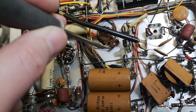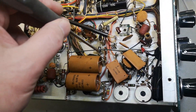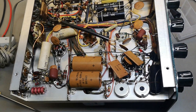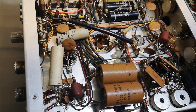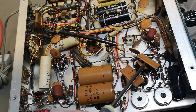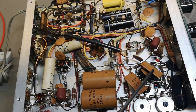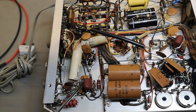The two primary windings are in series correctly, so I can plug this into local mains and we should be fine. This is a very impressive DIY project — not the easiest one to perform. There are a lot of components packed very closely, especially around the two more integrated tubes. This unit uses compactron tubes, which have about three elements each — like two diodes and one triode — more integrated than normal tubes that contain only two triodes.